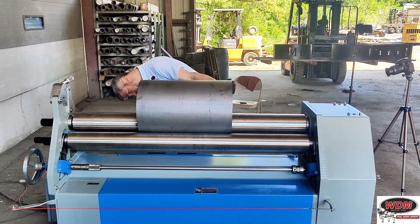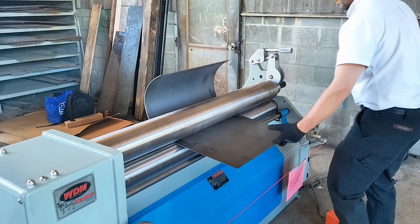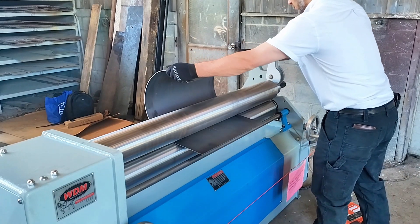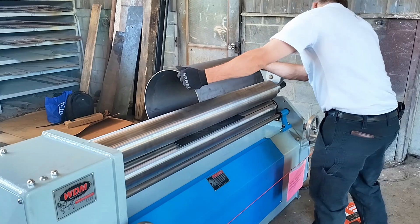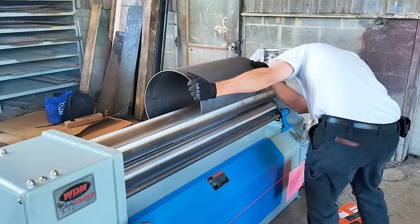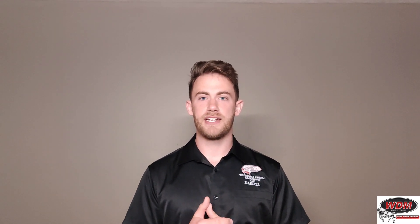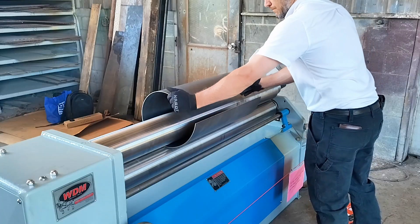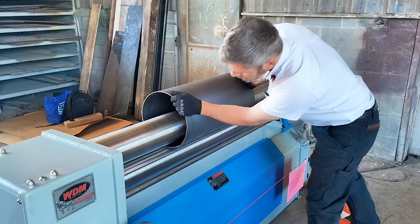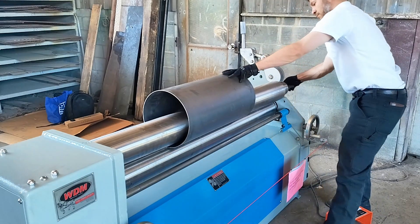Set the bending roll to the position you need and then continue cycling through. You need to roll it slightly tighter than the diameter you want to achieve, because of spring-back — how much it will open up when you take the pressure off the rolls. Whenever it's coming back around, make sure you prevent it from re-rolling and letting the second layer go under. If it's lighter material, you can hold it back with your hands, with an overhead crane, or we also offer an overhead support option.